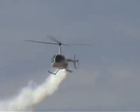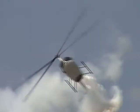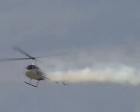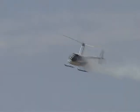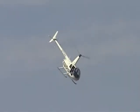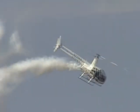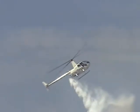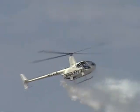If you tilt it back the other way with the little right, it goes to stop, it starts going right. Same thing works for fore and aft or any other direction that you want to face. So that's how you make a helicopter go whichever way you want it to go. And it'll go backwards: bring the nose up, it goes to stop, and starts going backwards. The rotor system does not care which way the tail boom is pointing.